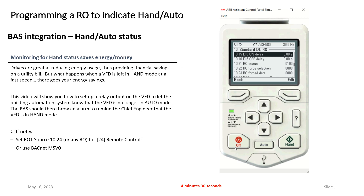A little pro tip: if you're running BACnet MSTP or any BACnet integration to the drive, there's actually a BACnet object for this. My favorite is using the multi-state value to see if I'm in hand, off, or auto. So if you do this over BACnet, it's actually free — you're not even running that wire. There you have it. If you have any questions, reach out to your local ABB representative or your friendly ABB HVAC application engineer at the factory. Thank you.